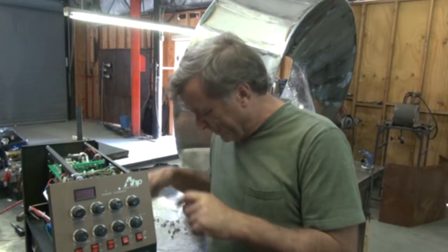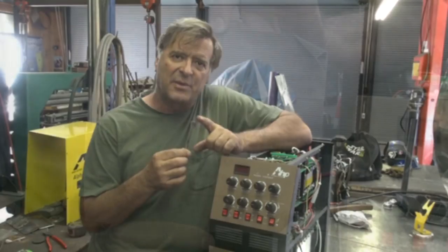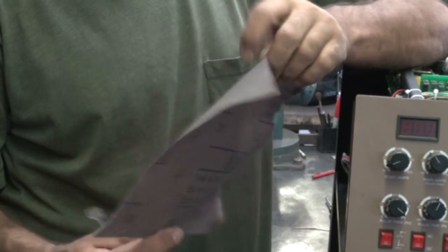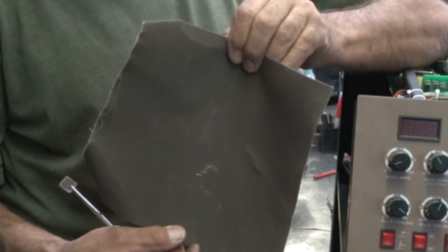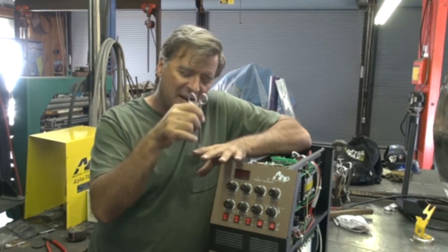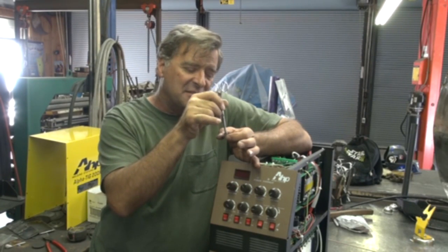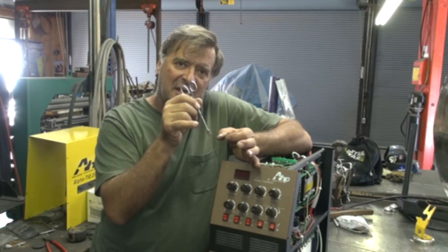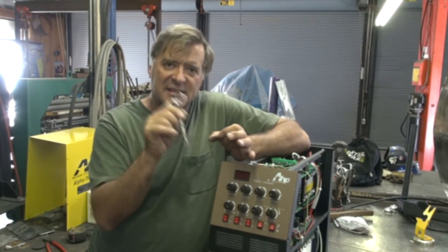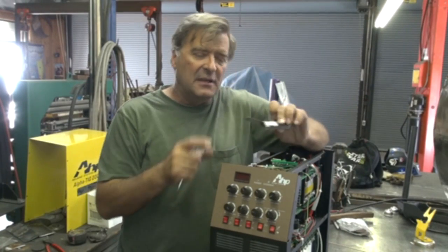So, this is what you do. What I've got here is just a little tiny square of emery paper that I tore off a big sheet. I put it in a pair of forceps, just because I've got big fingers. And you can reach down in there, right in between those contacts, and just scrub it on one side, scrub it on the other side. Give it a little blow to get the dust out.